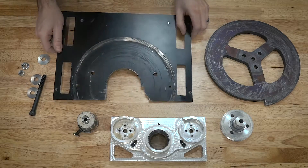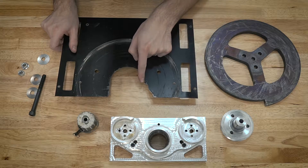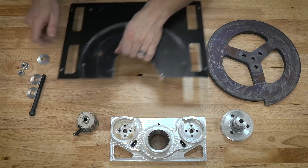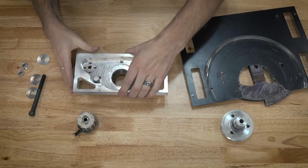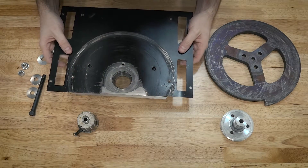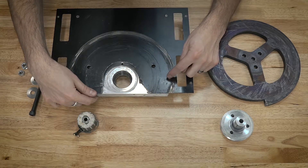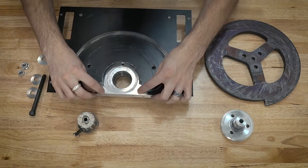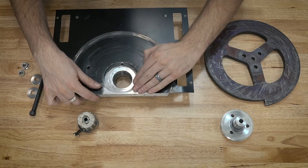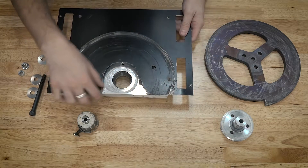Let's look at the armor plates. The armor plate actually fared pretty well, except for this corner that I think got knocked out in the very first fight. This should continue along here, but this little corner got sheared off. The reason this happened is because from the bottom view of the robot, the plate kind of loosely protects and is only held in place at two points, so these two pieces can flap up. What happened is the weapon was spinning around, this piece came up just a little bit, and got caught by the weapon and sheared off.